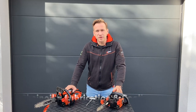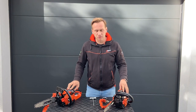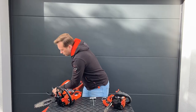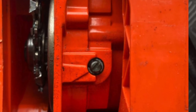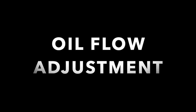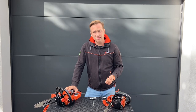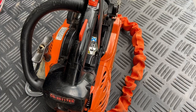This you will see in a video coming up in a couple of weeks. Most chainsaws have the adjustment screw on the top side or on the bottom side. The whole purpose of this adjustment screw is that you can adjust the oil flow based on the weather temperature, but also the type of oil you're using.